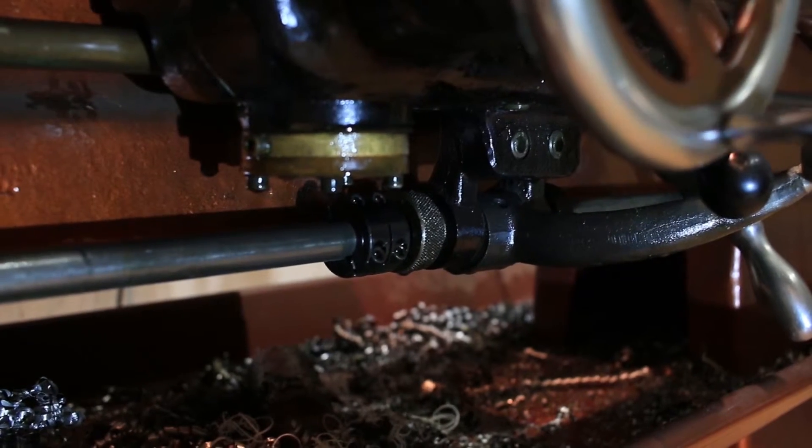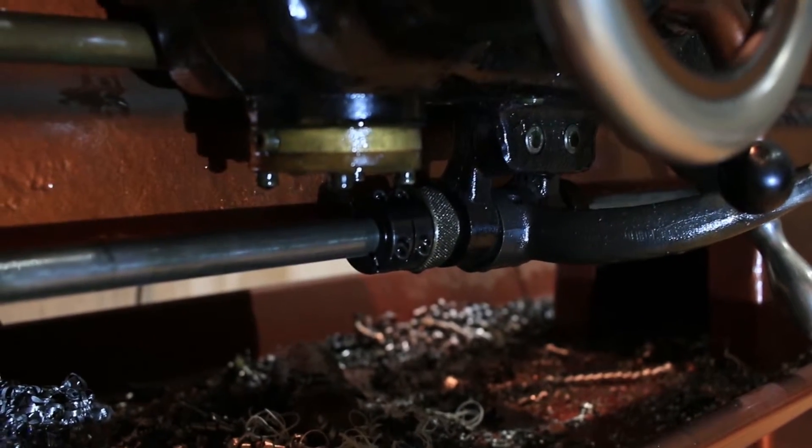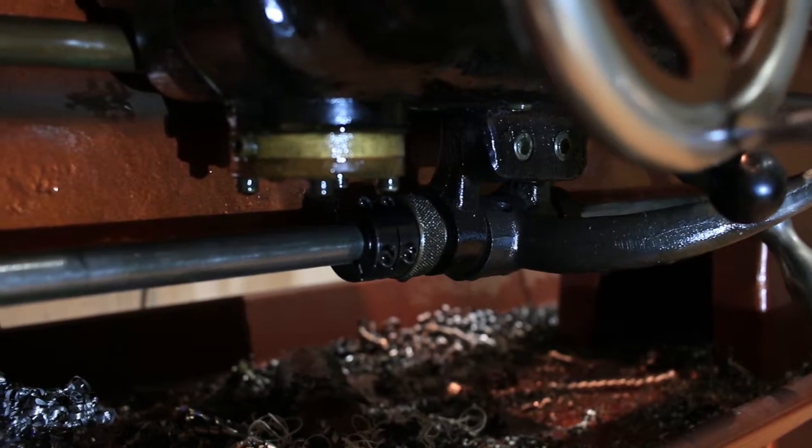As you can see, this uses a lot less thought than using a thread dial. But it can be even simpler. My lathe has this interesting feature: set this shaft collar up and the carriage will push it forward until it trips a mechanism that stops the lead screw.